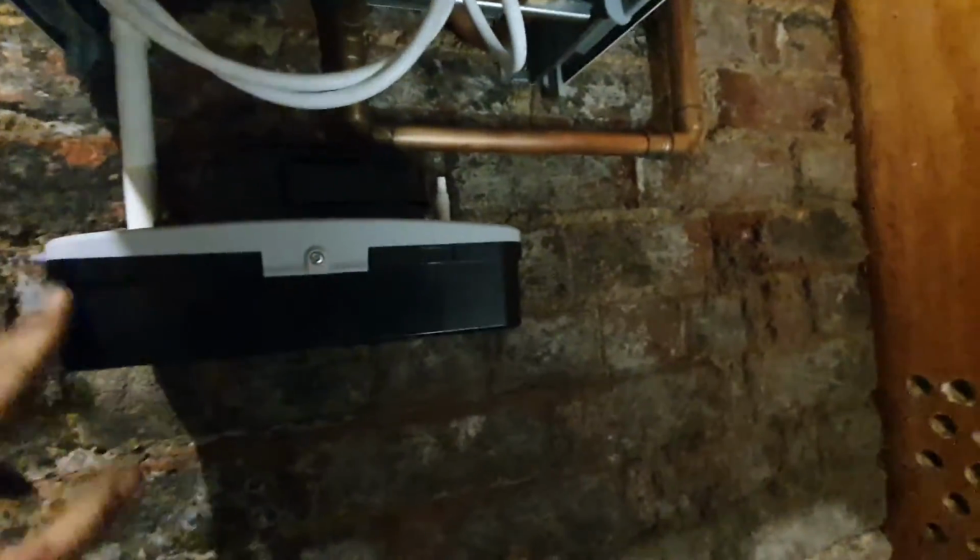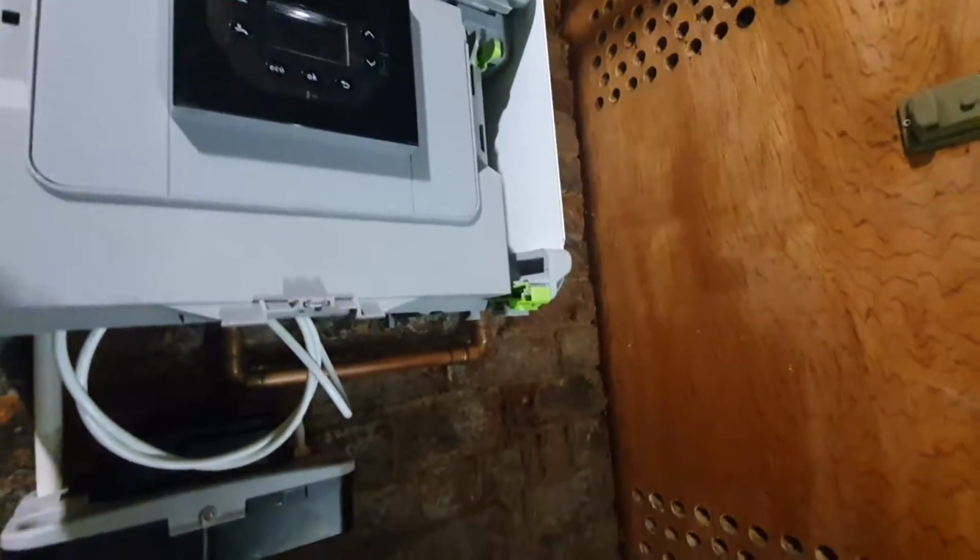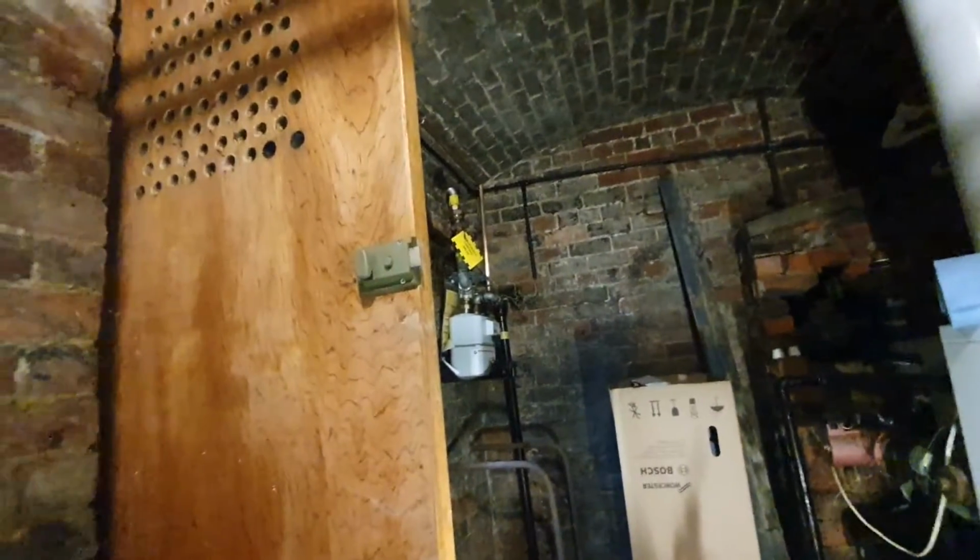That's basically the condense pump all installed now. I've just got to run the outlet off it. I want to get this off the floor in case this boiler room fills with water, you see. Obviously we're down in the basement. The good thing about this is you can also run a hose from the drain off tap on the boiler. It's just inside there. And obviously you can drain down and it'll pump it straight into the drain. So yeah, it's ideal really. Beautiful.